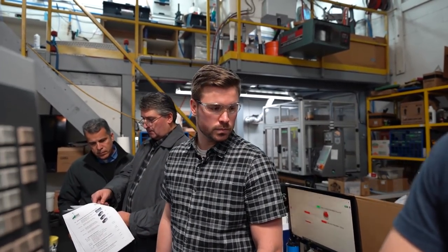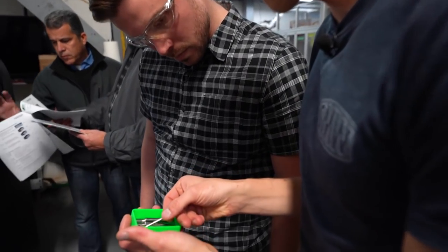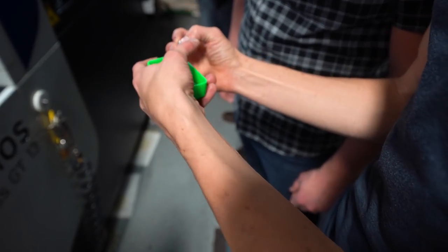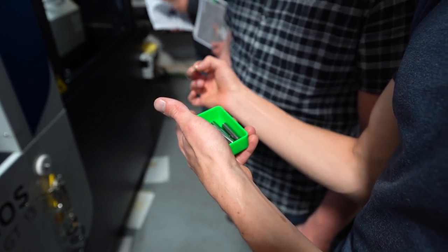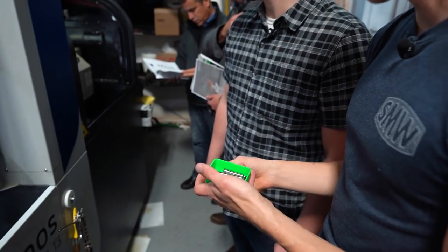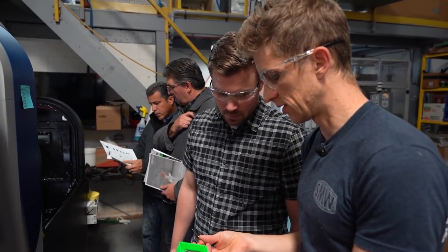Yeah. See, I also made all these ejector pins. Yep. So that threads into the sub-spindle side. The collet goes around it. Your part ends up right here. And then when the part's finished at the chute, the collet opens up. This guy, there's an air cylinder that goes pachoom, and spits the part into the thing. So I had to make different diameters so that we could do our different parts, right?